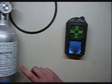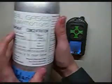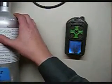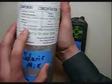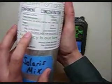The gas you're going to use by default from MSA is hydrogen sulfide at 20 parts per million, carbon monoxide at 60 parts per million, and a pentane simulant — we use 1.45% methane by volume. Occasionally a sensor can get poisoned and will still react to pentane but won't detect natural gas, so we like to use natural gas at all times, which is 58% LEL pentane equivalent. Oxygen is going to be at 15% to test the oxygen sensor on a bump, with nitrogen balance. Always remember when using calibration gas to check the expiration date and manufacture date — typically reactive blends will only last one year from manufacture.